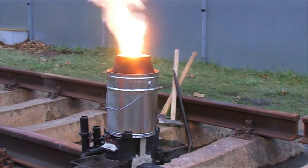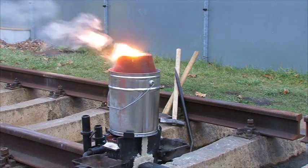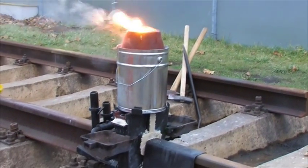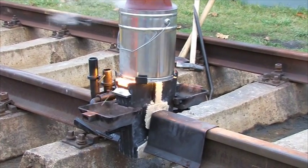After the segregation of steel and slag, the thimble melts through. First the steel pours in, then the slag follows and fills the slag pans. Once again, the pouring is shown as a simulation.